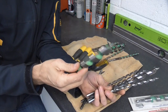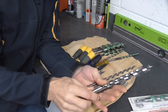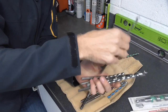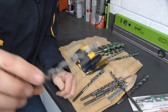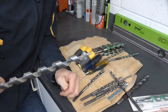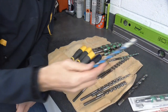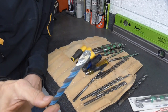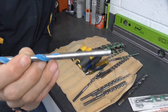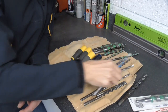I've got a 15 mil one there and I think the spur is perhaps even lower than the lip now, so that one creates a pretty rough hole — I need to replace that. So I've got two types of drill bits: ones I spend more money on and can sharpen, and ones I get through more quickly, like 15 mil and 10 mil, that I just replace as needed. I've also got an odd-size one — three-eighths of an inch — because I did a lot of specialist stair installations for a company that still uses three-eighths dowel. And there's a Bosch multi-purpose 10 mil, really handy for a quick single hole, even on hammer mode in a combi drill.